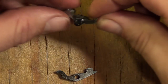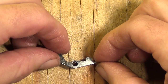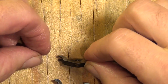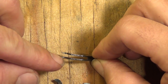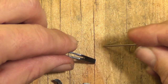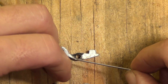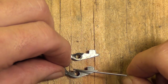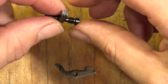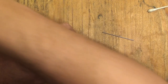Onto USFA. If you look at USFA, it looks like they pretty much copied a Uberti bolt — it's almost dimensionally identical. But it wasn't known as a trick back then to leave the working leg thinner than the other leg, so they certainly didn't. Because they made it just like Uberti, there's a sharp corner on the inside there. Other than that, for all intents and purposes, it's a Uberti bolt. That can be a nice thing — because if your bolt ever breaks, you can go to VTI Gun Parts and order a Uberti bolt, and you can usually fit it to a USFA just fine. There's your spare parts problem solved for a gun company that's no longer in business.